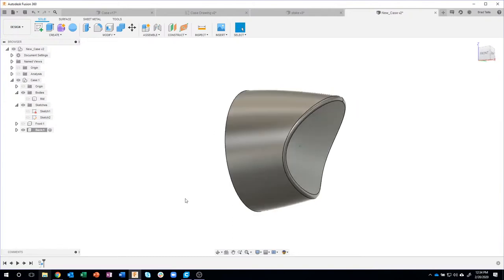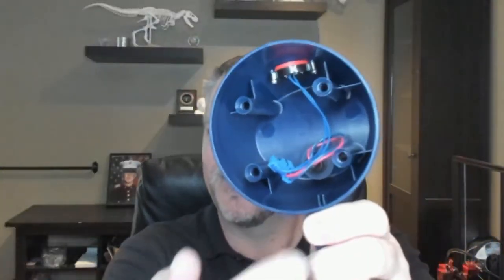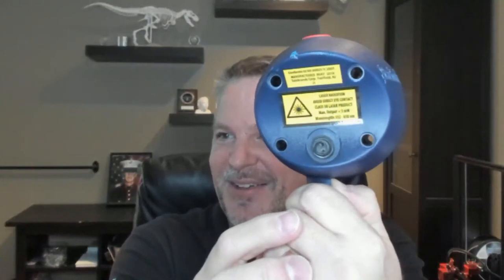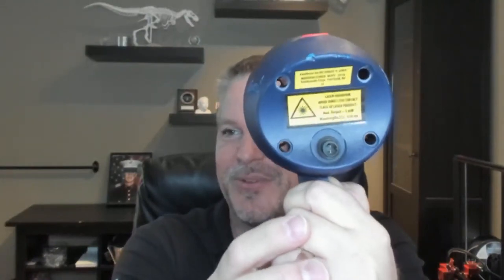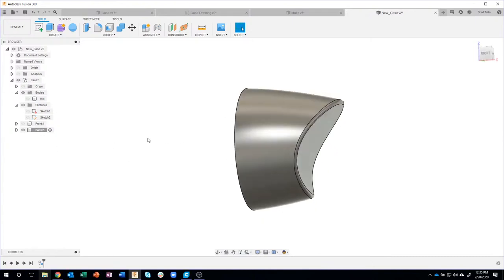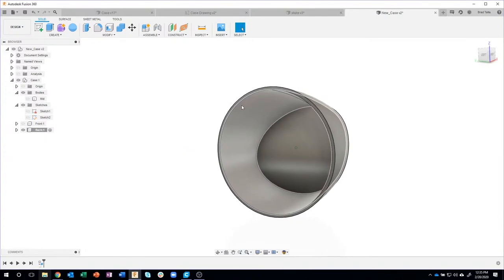It's the basic shape of the part, but obviously we need to come in and add a lot more information in here. So we're going to be creating all these little ribs, and we're even going to do the decals on the back and those recessed holes and all that kind of stuff. So that's what we're going to be doing next. Okay. So we created the component, we activated the component. Now I want to basically create those screw bosses.